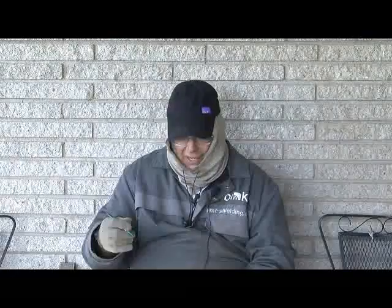And so we just got some aluminum screen wire. We rolled it out in front of the door along that wall, and we sat there with the meter running, and we got it down to like 20 microwatts then. And so see, that distance wasn't as powerful, and so that screen blocked it. So that was very encouraging. So we're going to go back probably in a week and build a wood frame, 2x4 wood frame, on that side of where the meter is, and put the aluminum screen wire on there. So it won't be stopping the dirty electricity, but stopping the neighbor's meter. This person's meter is very close to the house there.